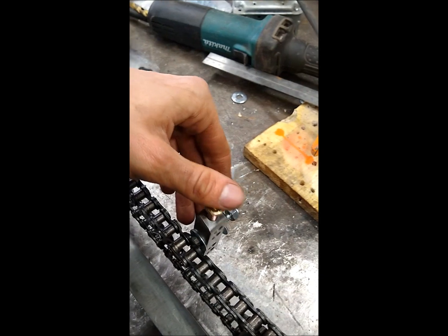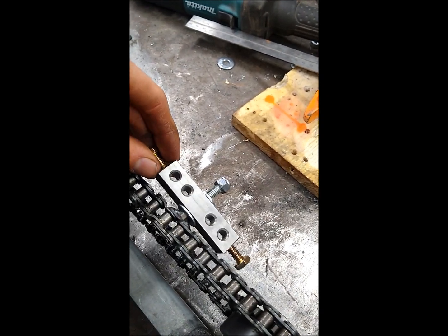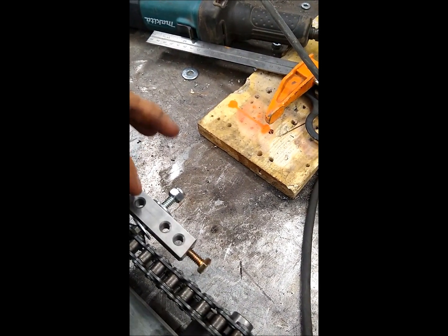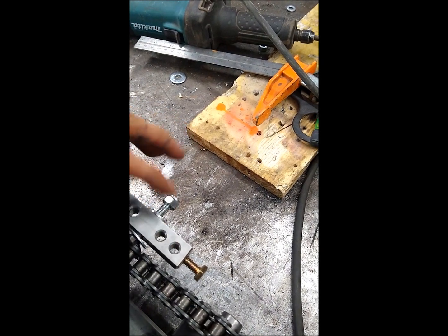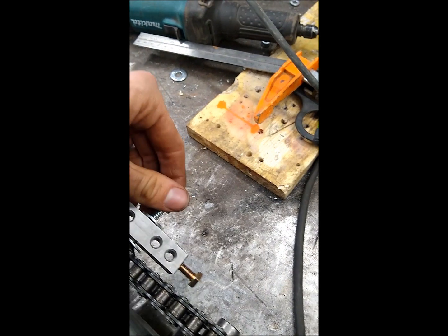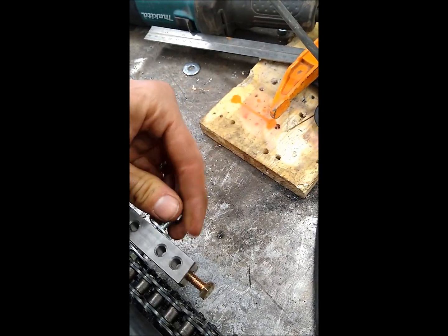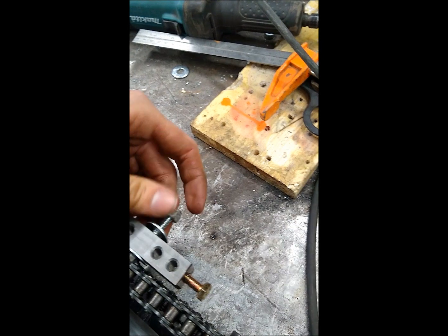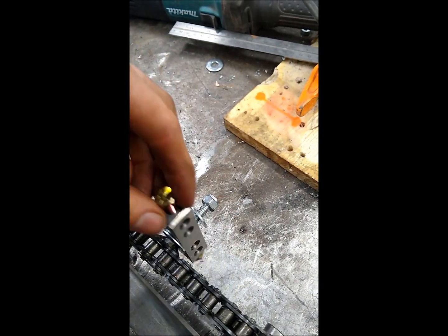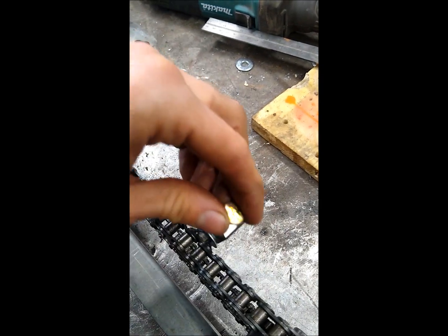The purpose of putting this roller chain and sprockets on is so that you can update it with the newer parts and also with cable. This block has been specially machined by us at Commodity Traders. You thread your cable through there, it makes a loop and goes back through this hole, and it's locked down with each of these bolts. I have a Teflon locking nut here so that you can run it up close to here without clamping it too tight. If you were to clamp it tight, this would not be able to spin freely. It's important that this spins freely.